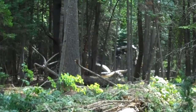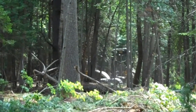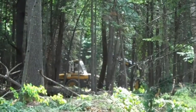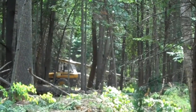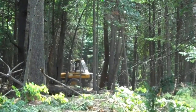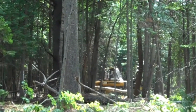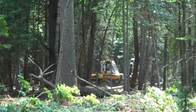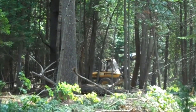To be honest with you guys, the hardest tree for these machines to cut is hemlock. These machines were originally designed to cut all softwood. But if I was in a big upland hardwood stand with sugar maple and yellow birch, I wouldn't use this system. It's about putting the right system in the right wood — they're just not made to cut that kind of wood. It's hard on them.